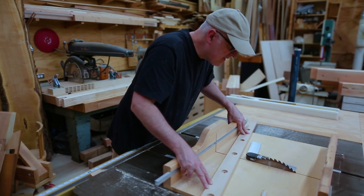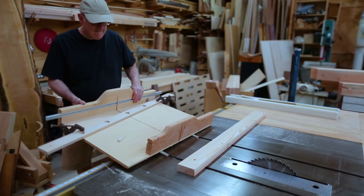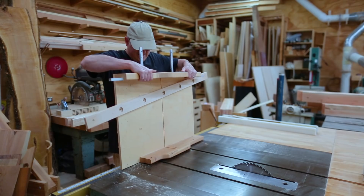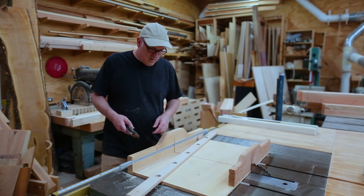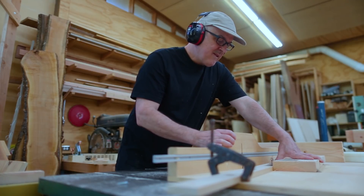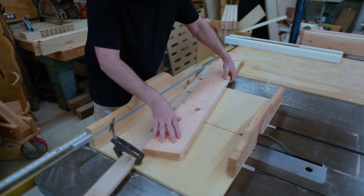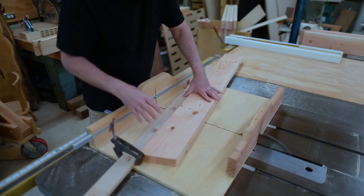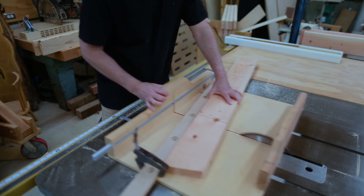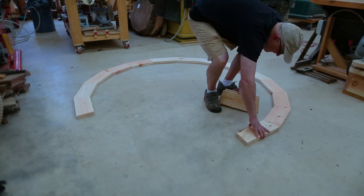To make the arches, I wanted to attach a bunch of shorter two-by-six segments to make the curve of the arches, so I needed to cut an angle into the two-by-six pieces — basically making big segments for a segmented ring. I was wondering how I was going to hold these as I glued them together, so I continued down the path of the segmented ring and decided I could glue the arches up as a ring, just not gluing the joints I wanted to come apart, giving me two arches from each half of the ring.